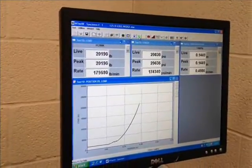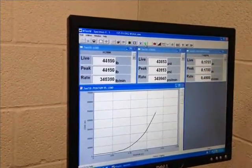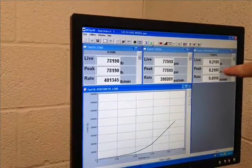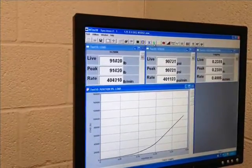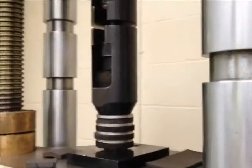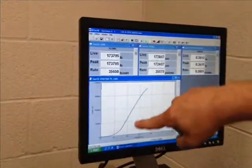The graph is performing as expected with a consistent linear curve with elastic behavior. This first section of the curve is called the elastic region. At this point, even though the specimen has stretched and deformed, if the test were stopped, the bolt would come back to its original shape and length. The curve will remain linear until reaching an elastic limit, then entering the yielding region.